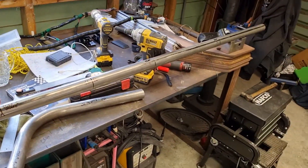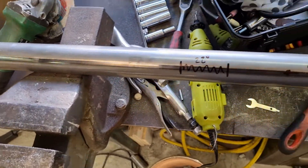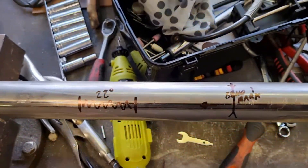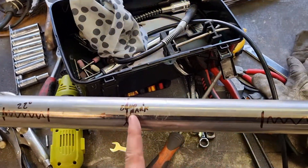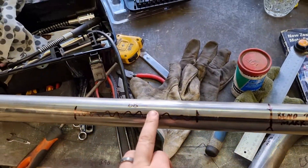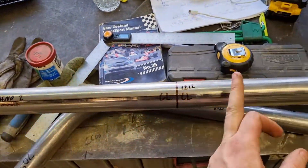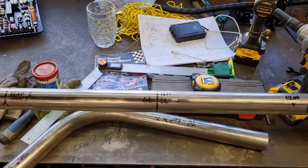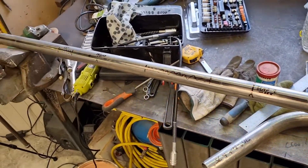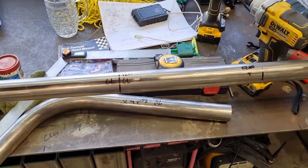What I've done here is cut my piece of tube the right length, then measured out where I want my bends. I want a 22-degree bend starting here and finishing here — that's my mark for my jig. Then I want a 68-degree bend through this section. Then this is my centre line. Always good to mark your centre — once it's bent it's very difficult to find your centre again if you haven't already marked it.